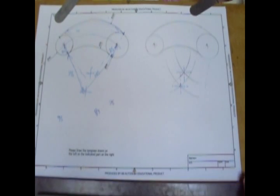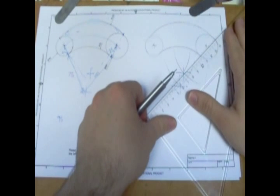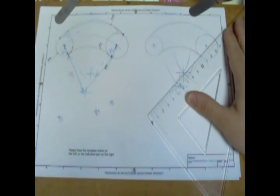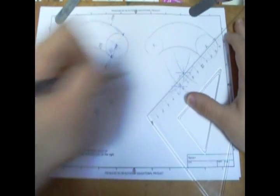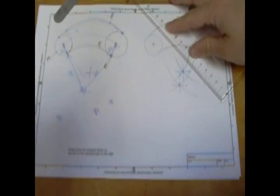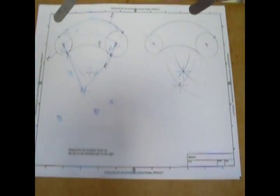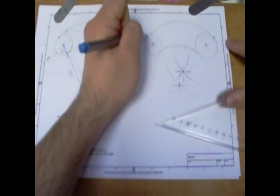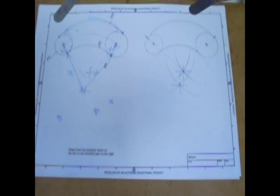Finally, if you remember rightly, we've got to do the points of tangency. This is really easy — you just have to remember what centre goes by what curve. The top curve is the top centre. The point of tangency is always through the two centres. So if you do a line up to here, this will be where the point of tangency is — it's gone through the centre here and through the centre here. Same again for the other side for the top curve, you'll find that it meets. Use the grey pen just so you can see that the lines — the centres — line up. Some drawings you'll be able to see that's definitely the point of tangency; others it's rather difficult to just be able to tell where the two lines actually meet.